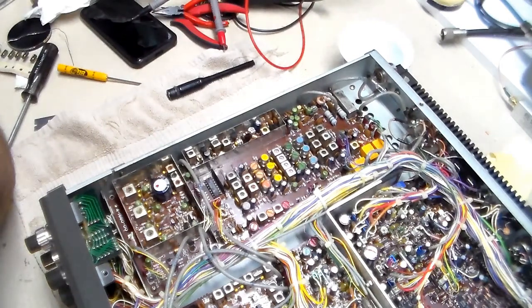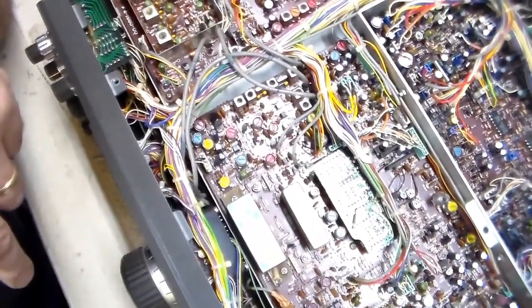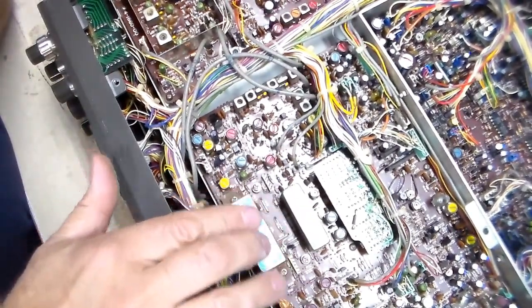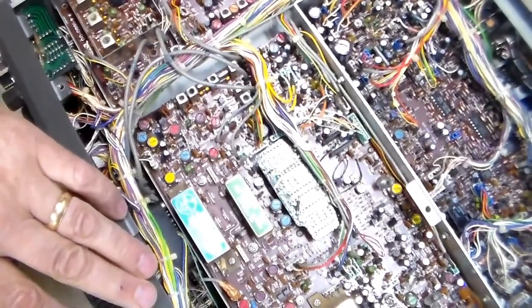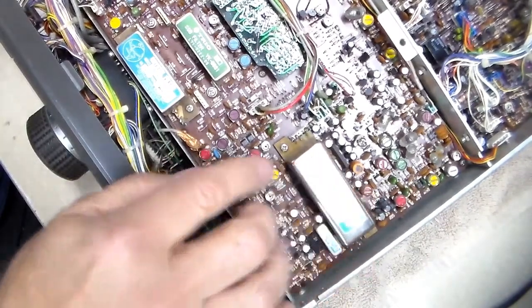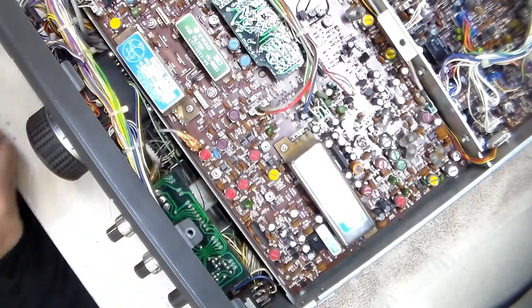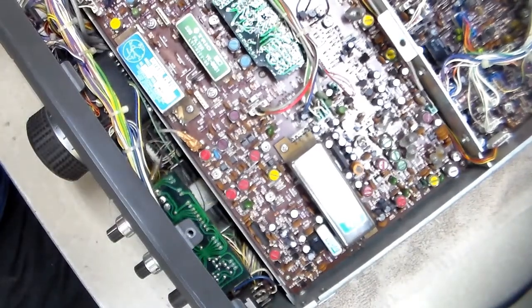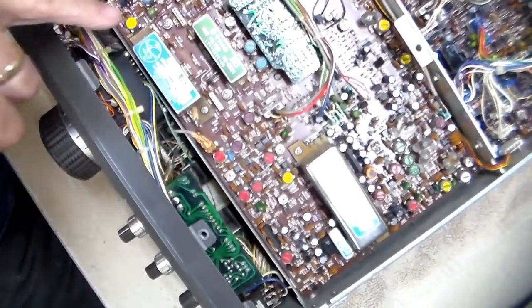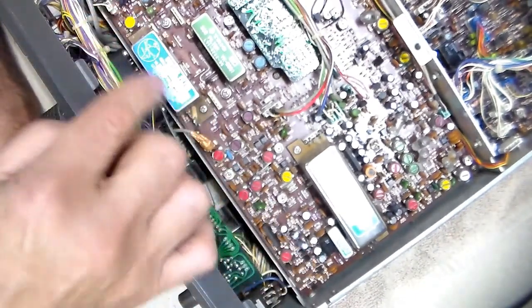Guess you notice like some of this here. These, let's see if you can see what I'm looking at. Well, probably not completely. Try to get you a better view. Down a little bit more. Ooh, that's scary. Okay. These filters, this filter, and then this one that's over here, and if you look at this guy here, you'll notice that these pins are kind of soldered on there. I guess this must have been an aftermarket filter. These are supposed to be really good filters, but I guess these were like a fits-all, so that's why they had to cut, and basically they cut the Molex pins, or the standoff pins, on, I think it's just this side, and then you had to solder the wires.